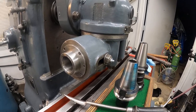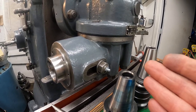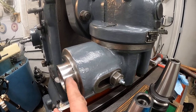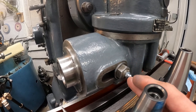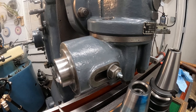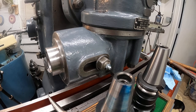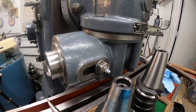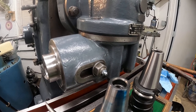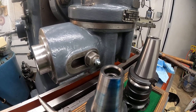What I did with this head here is I took the baffles out and pumped three tubes of grease through it and pushed all the old grease out. Luckily, this thing sat just right in the junkyard so the water didn't destroy the bearings. I'm going to load this video — tomorrow's a new day. Thanks everybody, God bless you.